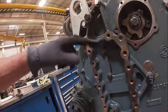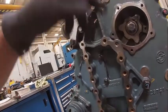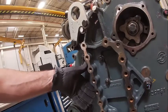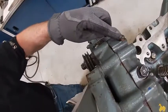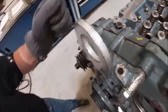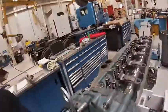Right here, this fan drive mount — there's a cover right here. We looked at it earlier when we were adjusting the backlash on the gears. That's where I would take this plate off, install that tool in here, and then up on top you can see there's a plug here and a plug here. That's how you move the gears so you can measure the backlash. We would screw our dial indicator into here, and that would bring it out, so that's how we can do that.